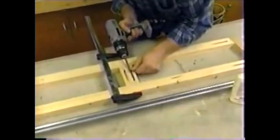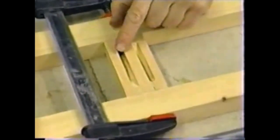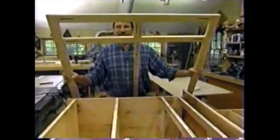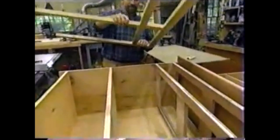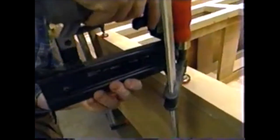On this small center block between the drawers, I had to offset the pockets, otherwise they would be lined up. Even though the glue hasn't set, you can see how strong it is with just those screws. I've applied some glue to the sides of the cabinet and the dust frames. Now I'll position the assembled face frame, clamp it, and attach it with some brads.